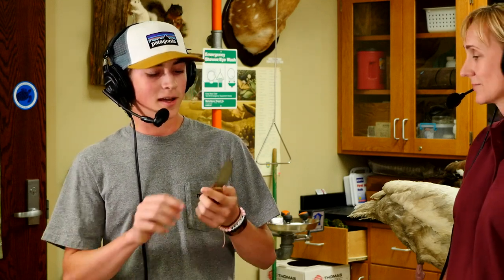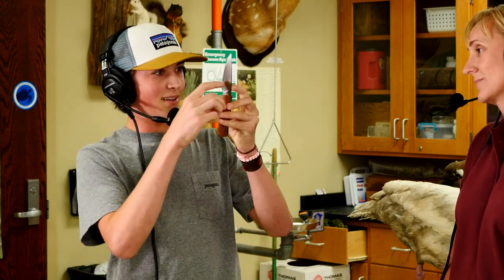You'll start out with a block of material, and the first thing you do is drill your holes on the side of the knife to keep it stable. Then you've got to contour your front, which is a mistake a lot of people forget to do. They'll not do it, and then you'll have a block attached to your handle that's two different lengths on the side, and if you try to go down and grind it, you're going to scratch your blade all up. So you do that, and then you're ready for gluing up.